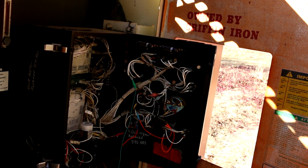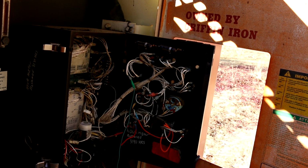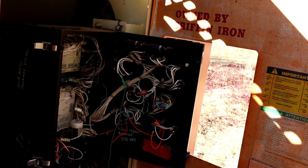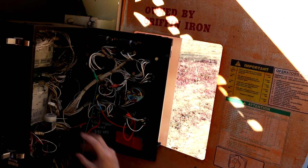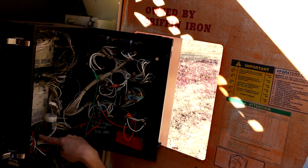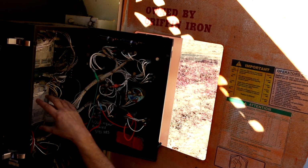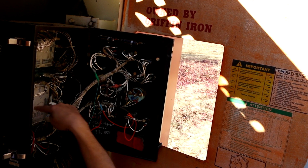So unfortunately for me, it means that nothing's coming out of this board at that pin when I actuate the controls up there in the aerial. Even though we saw that the input and output diagnostic lights were flashing like crazy, which according to this chart right here, it says flashing SF4 OK, SF4 OK, SF4. The SF4 is the board. And what they're basically saying is the Superflex is doing what it's supposed to be doing. At least that's what the Superflex thinks.